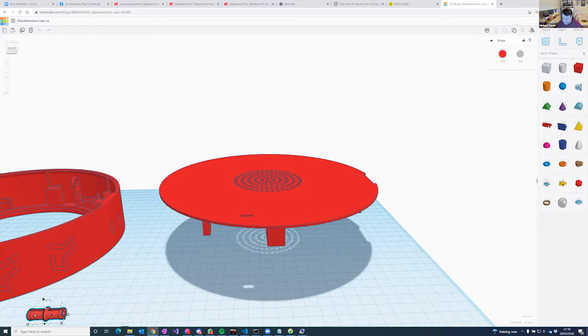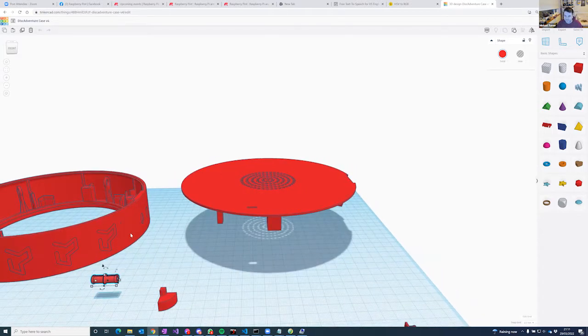One of the other reasons is when you're 3D printing, you print horizontally, and where your strength lies is in that horizontal layer. The gaps between layers is where you tend to get a snap. So if I was printing this with the lug sticking out, then its weak point is the horizontal bit, so it's far more likely to snap off. Whereas I can print these laying down, so they have strength lengthways. So it allows me, with reasonable confidence, to open and close it. And if I break it, I don't have to spend a day reprinting the case. So that's kind of the case element to this.